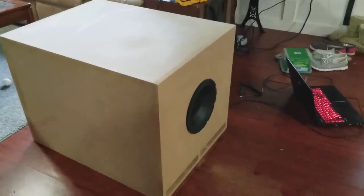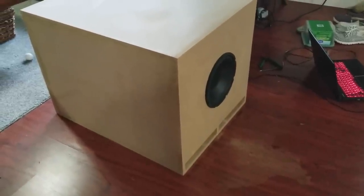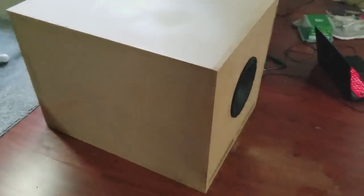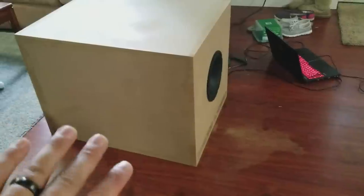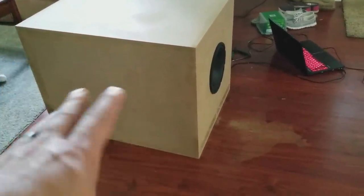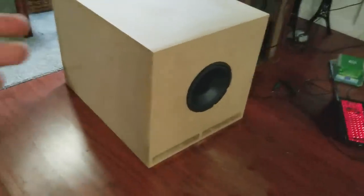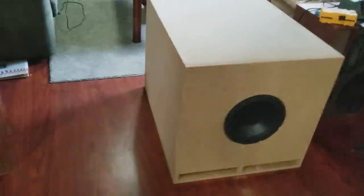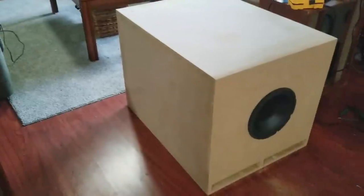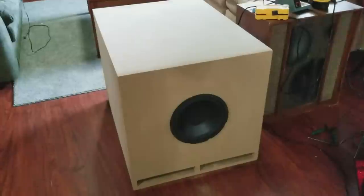However, if you're running an acoustically transparent screen, for example, and you have a bunch of space, so you have a false wall and a bunch of space back there, this could be one of the better budget setups out there. Just stick with me for a minute. You could run four of these across your entire wall, and it would take up most of the wall, but you could tune them to 20 hertz, and you would only need something like the SPA500 or the SPA250.